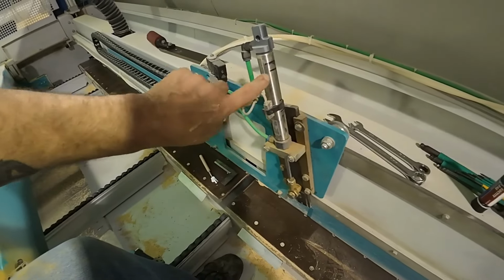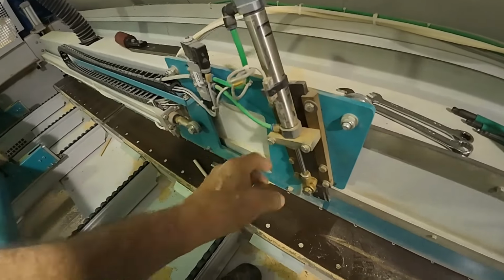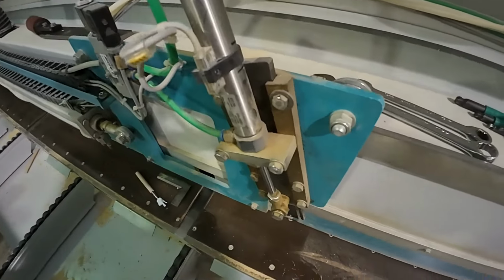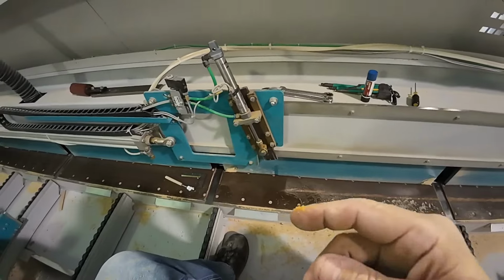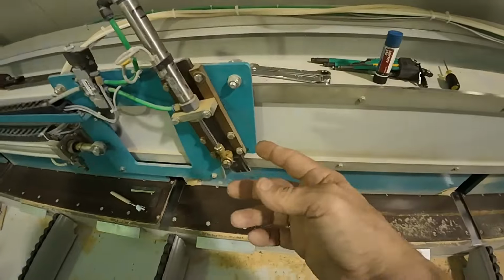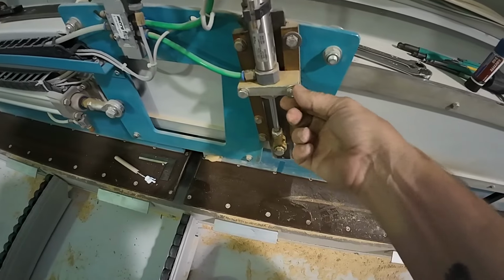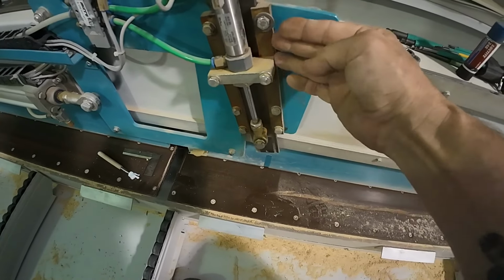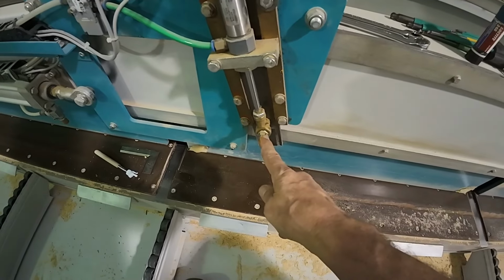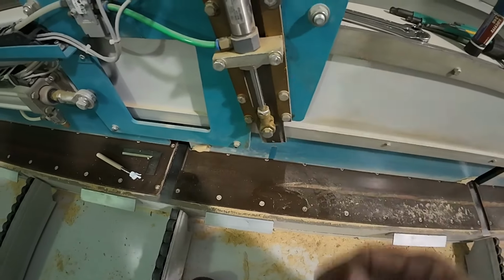I took this sensor, made a mark where it started, dropped it down, and found the position of the magnet so that when this was bound into place, this would not move. At that point, parts were ordered. Obviously they've been received, and now I am going to put this in. So what we're going to do is break these loose and physically pull this one completely out so it releases this guide. Take these out, take the end of our clevis off here for our shaft connection, take it loose, and slide the new one up in place.